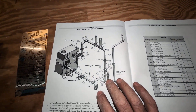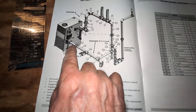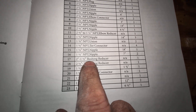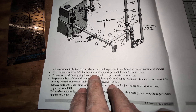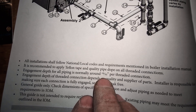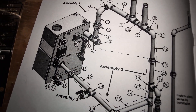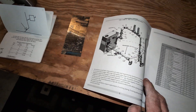This is the piping diagram that comes with the boiler. It tells you two and a half inch here, but then it calls out about an inch and a half here — they put a bushing there at position 17. They do say to recommend using Teflon tape and pipe dope on all threaded connections, and there's your 19/32nds per threaded connection. They're calling for a nine inch coming out here so you can spin the tee on without taking out the sight glass fitting — I opted to take out the sight glass fitting as we discussed earlier.